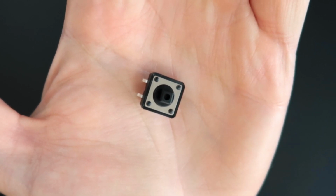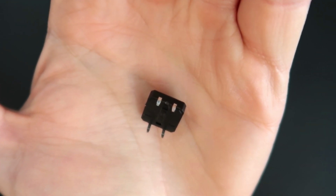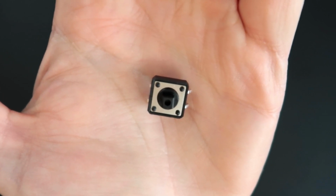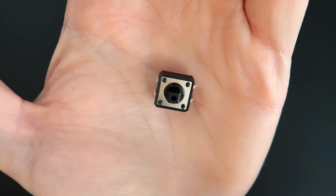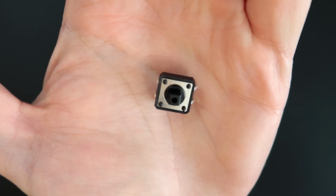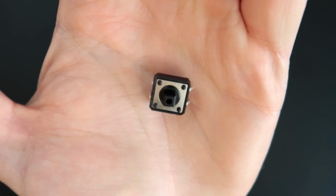So in the prototype, we're going to use tactile buttons because they have those legs that are easy for us to snap in the breadboard, okay? But remember that they work in the same way as bigger brothers like arcade buttons. So keep in mind that we are making a prototype, but once you understand the prototype, it's really easy to go to a complete project, like soldering wires and using better buttons, better potentiometers, and then go for the controller that you actually want to build.